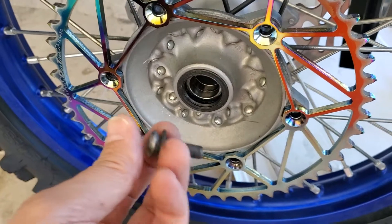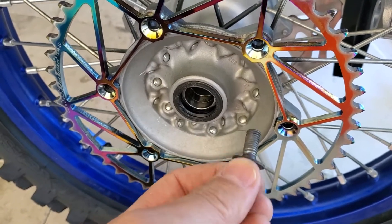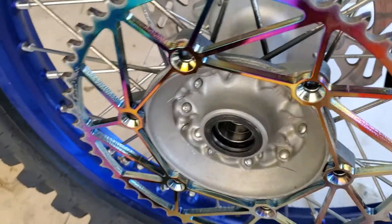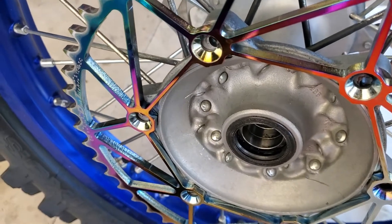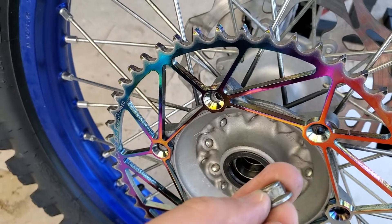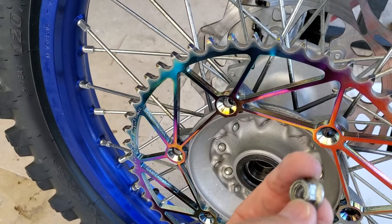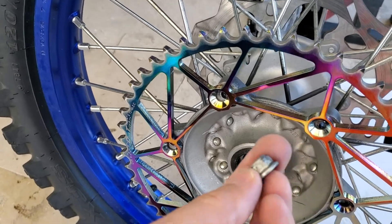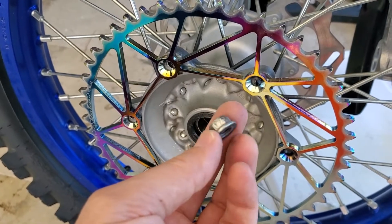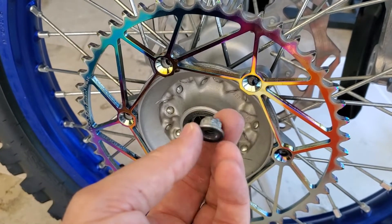But I don't think that's the bulk of the theory. I think the main issue was these washers — I don't think I'm going to use those in the future. What I think happened is the washers kept my lock nut from getting all the way onto the shaft of the bolt. The bolt wasn't penetrating through the lock nut far enough to actually make the lock nut work correctly. That might have been my biggest factor in losing bolts and tearing things apart.